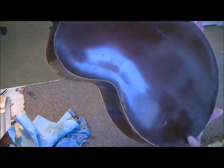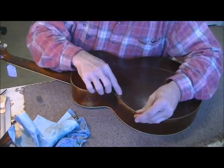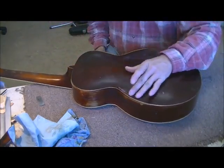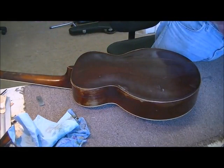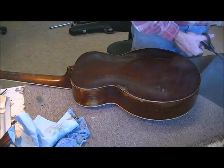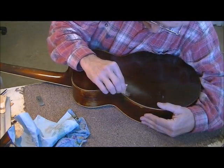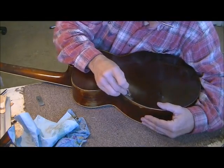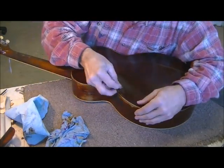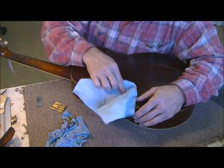It's not too bad compared to the way it was with that big glob of junk on there, but it's still rough with a lot of rough area. I'll take a little piece of 400 wet-or-dry and lightly scour that area to smooth off all that roughness. That actually improved it a lot — still didn't take off much finish, although there are a spot or two where I can tell there's still glue on top of the finish.